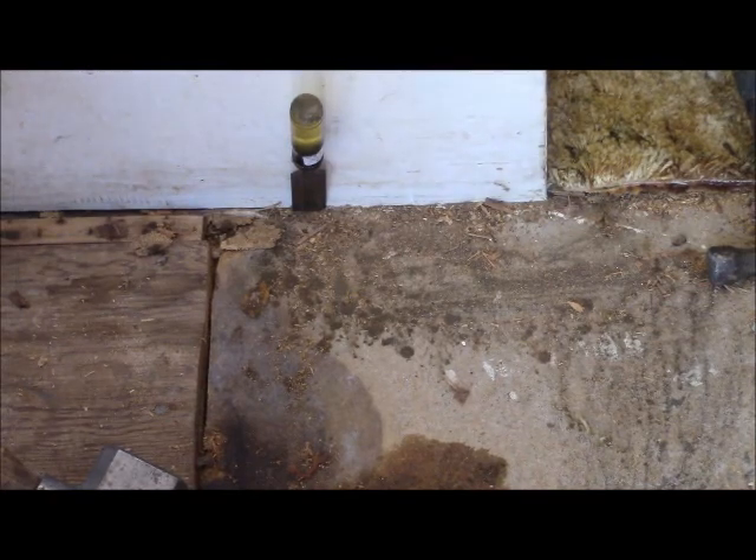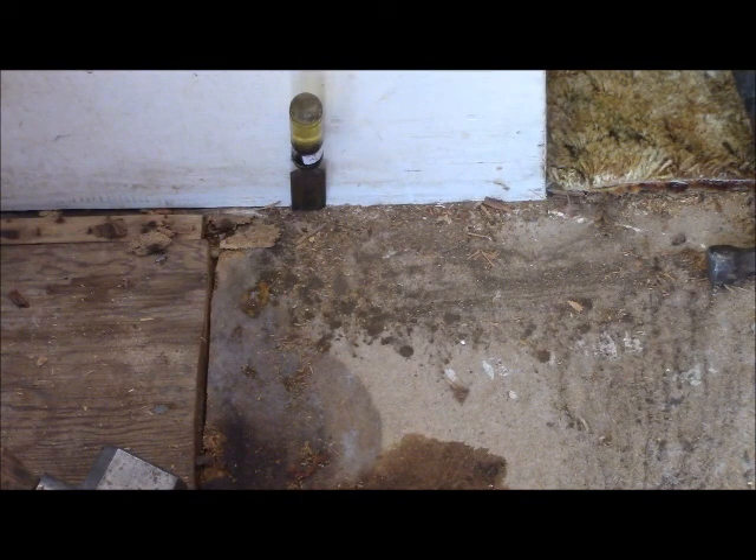On that piece of press board against the wall, what I'm doing is taking a chisel and making a cut down through it. I'm not necessarily getting absolutely to the bottom of the board, but I'm taking eight good strikes with my soft hammer. And if you ever wondered, this is what those two and three-inch wide chisels are for that you see occasionally in the hardware stores.